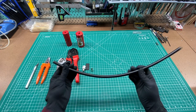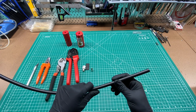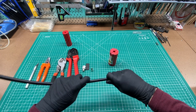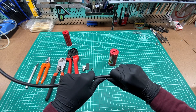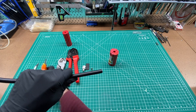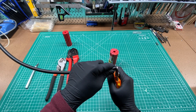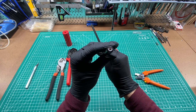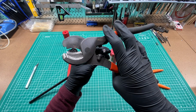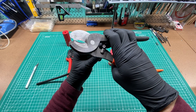The first thing we're going to do is square up the ends of the coax. This cable came off a spool, so it naturally wants to curve, but when you're putting it through the stripping tool you really want it to be straight, so I kind of bend it the opposite way to make it nice and straight. Once I have it where I like it, I'm going to square up the end with some cutters. You can see it makes an oval shape, so I'll use the nubs on the sides of the other cutters to make that round again.